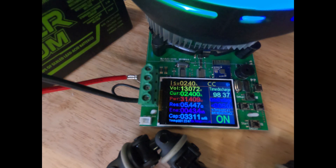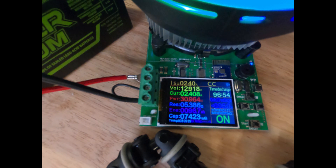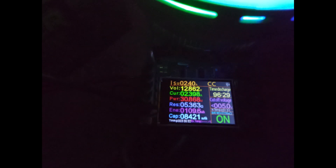Taking a look at build quality — this is a time-lapse of the capacity tester. Each frame of this video is one minute long. With this being a 12 amp hour battery, we are going to do a 0.2C discharge test, which comes out to 2.4 amps. In a previous video I tested a lithium ion battery, and the voltage range of that battery is a lot lower than these lithium iron phosphate batteries.